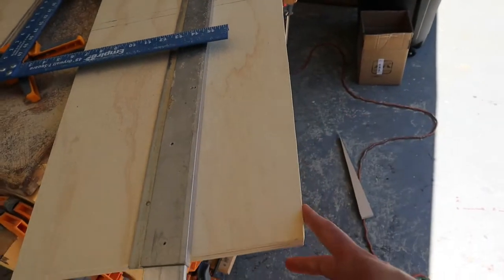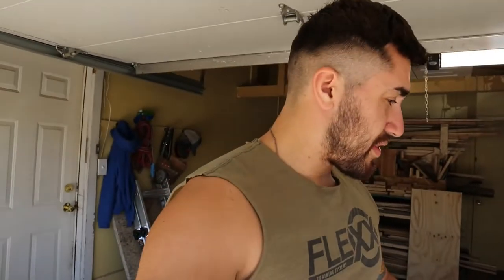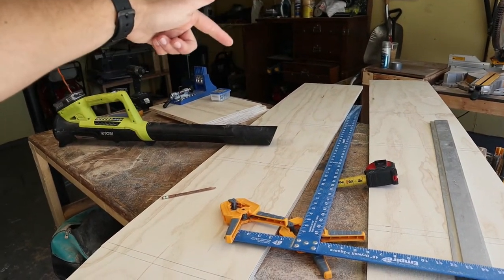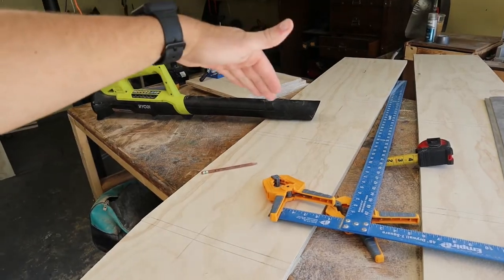We have our cut. I have a little bit of a misgroove at the top and bottom here on this side — kind of bummed, but these things happen. We're going to hide it — that's the perks of woodworking. The next thing we need to do is take our shelves and get to pocket-holing these, and get our bottom and top ones in place because we've got to get our drawer slides situated before we put in our middle shelf. So let's do some pocket holes.